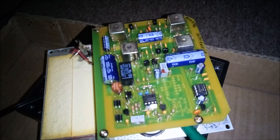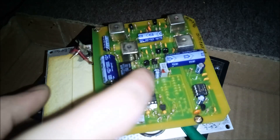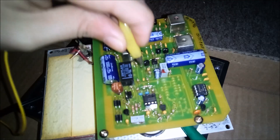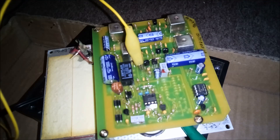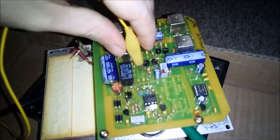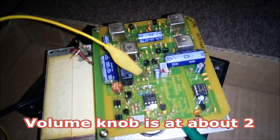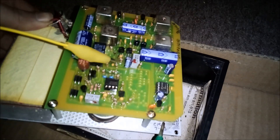I found several input points — the way I find them is I touch them. If you've ever had a guitar amplifier, you pull the cord out and touch the quarter-inch jack. So we've got one here, one there, one there. This one's kind of weak, this one's kind of strong, so here would be a medium-strong input. But here is a hella strong input. Take your ground from the case.